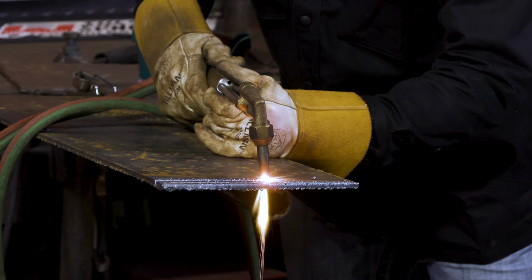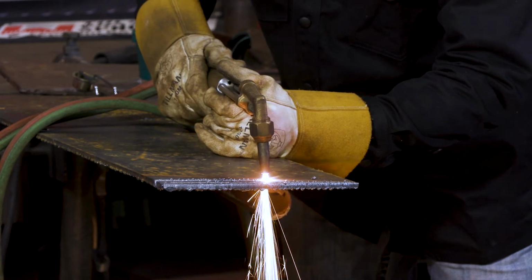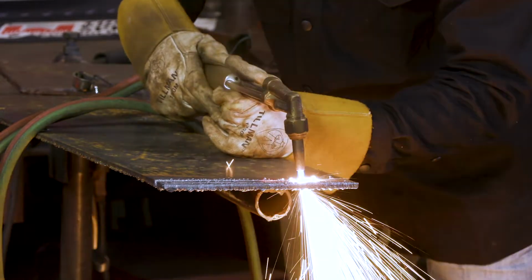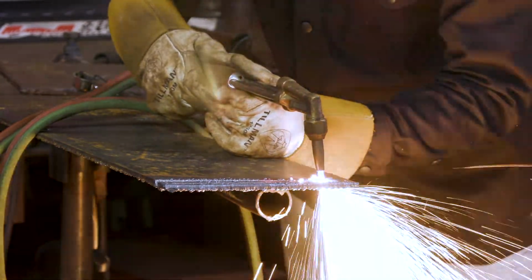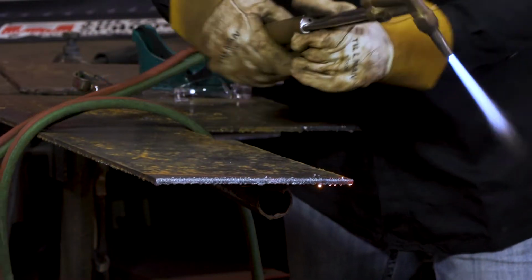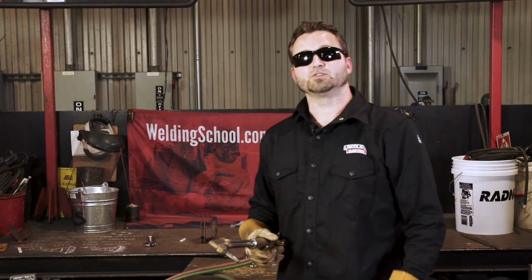Here we go. Ease down on your trigger. Starts to cut. Nice and smooth. You're back up and running again. And that's how you make a nice clean cut using Oxy-Fuel acetylene or propylene. And thank you for watching.